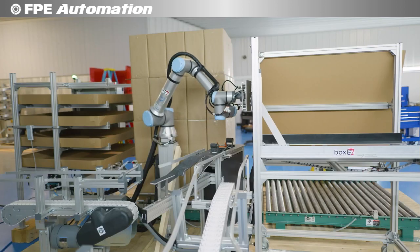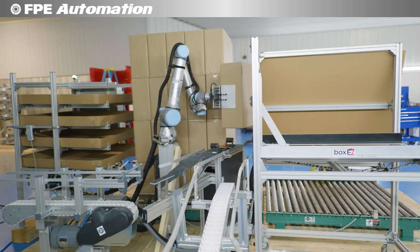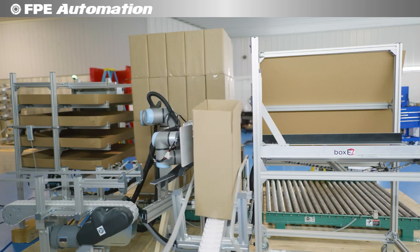I'm not saying we couldn't put an industrial robot on it if your application needed it, but with the collaborative it's really nice — they are so easy to work with. It's collaborative not just in the sense that it's not going to send you to the ER, but collaborative as in my marketing-major self can actually program one of these, which is not something I can do with one of the big industrial robots. So it's a really versatile, easy to install, easy to reconfigure, and easy to redeploy solution. If at some point you want to stop erecting boxes and case-pack or palletize, we can actually design the end-of-arm tooling to do double duty — you can make a box, send it down a conveyor, that same box can come back completely loaded, and that same robot can then turn and palletize, which allows for a lot of bang for your buck when it comes to ROI.